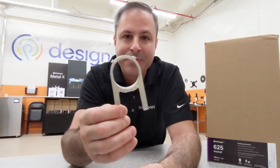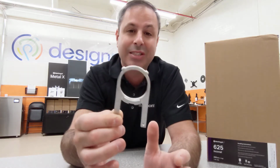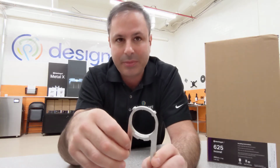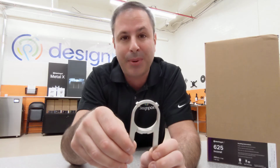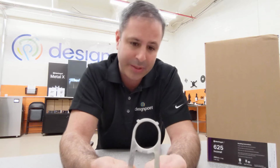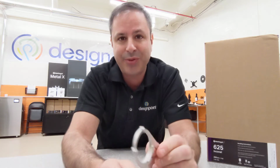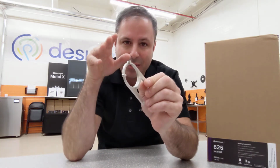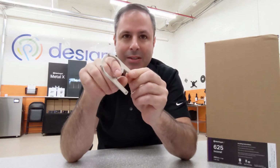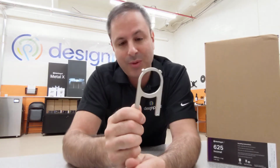It's a super alloy. What's great about it is its resistance to high temperatures, and it's very, very corrosion resistant. So what's cool about 3D printing Inconel versus machining it? Well, from what I understand, it's a very hard material to machine because it's so resistant to high temperatures. So you can imagine if you're cutting into a metal to machine it, you're creating a high temperature at that point, and Inconel tends to continuously work harden as you machine it. So when you're 3D printing it, you don't have to worry about that.